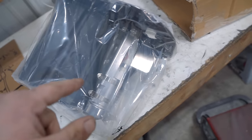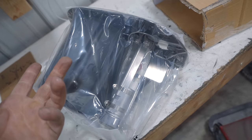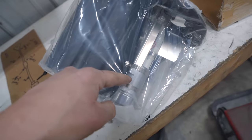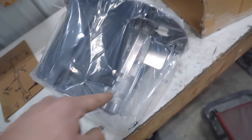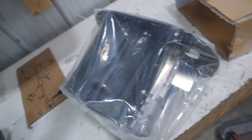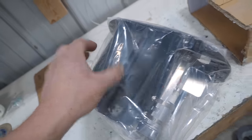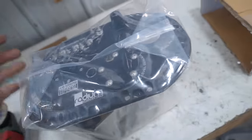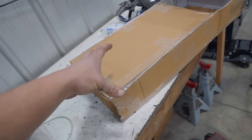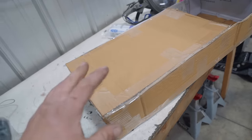So how this works is this is, you'd consider, I guess, the lift pump. This guy right here is gonna feed the two Walbro 450s that are inside. So this is a single Walbro 450, and then it goes to the two internal Walbro 450s. Now, the footprint on this guy is massive. So we actually need to widen this up to a foot. We're about 11 and a half, so we're gonna have to go a half inch wider than what we currently have, which is not a big deal, there's plenty of space.